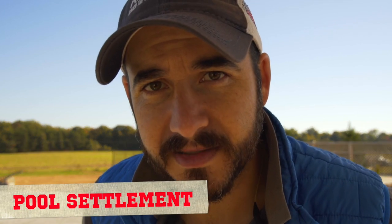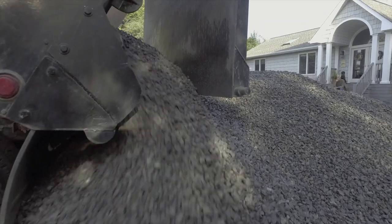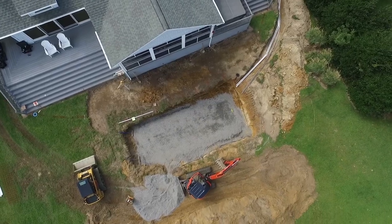Number two: pool settlement. There were many cases where the pool itself actually changed position, settled and shifted — yes, the entire pool — and this would occur long after installation was complete. The culprit was again sand. When groundwater is introduced, the sand base would liquefy, allowing the foundation of a pool to shift easily, making room for that pool to settle further into the ground. That is a costly problem to fix. So the Rhino Rock solution is clean crushed stone used as the foundation instead of sand. Because of the shape of the stone and the lack of smaller gravel and filler material, it easily locks into place as a foundation for a fiberglass pool, preventing settlement and shifting from ever occurring.